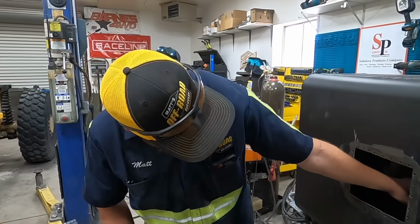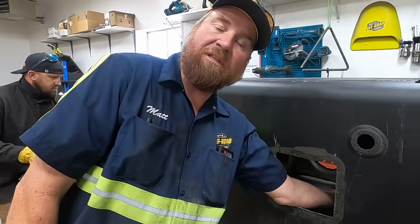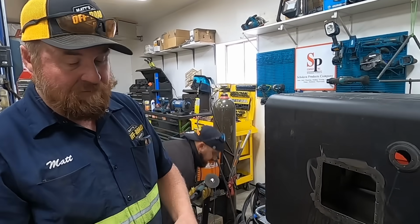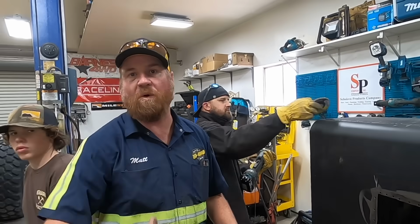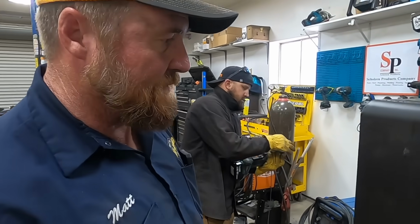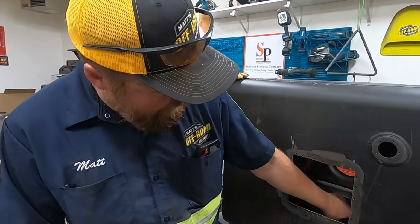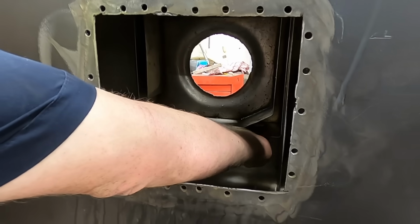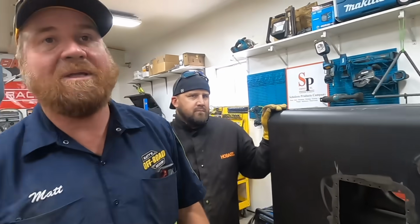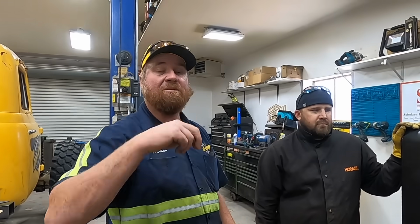The fuel actually gets into the sump through a small hole here. That's already engineered into the tank. I like the way it is and I'm not gonna change it. All we're doing is stopping the rogue waves from bashing the sending unit and the pump system to pieces. Once the fuel gets below this level, all the fuel comes in this hole right here. And it has to go through that cinnamon roll and then it'll drop down into the sump. The return also dumps in the sump, so every bit of gas that goes in there stays in. It never gets ejected out of there.